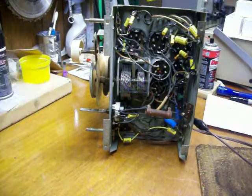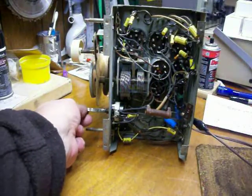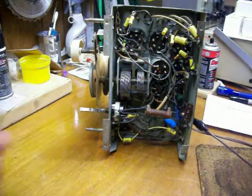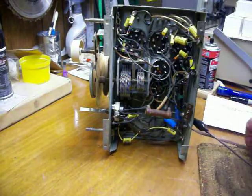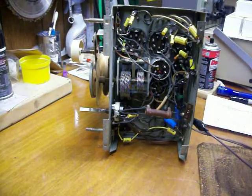I'm pretty much finished with the actual electronics. I do have to replace the line cord here, and that's a minor item. I think I'm going to add a resistor in there to bring the voltage down from 125 down to 110, where this radio was originally scheduled to operate at, which will increase the longevity of it.